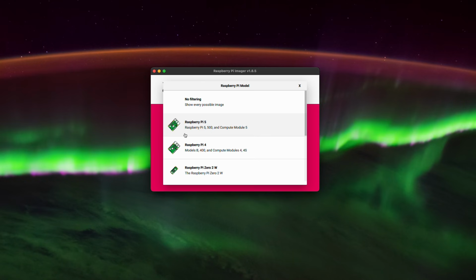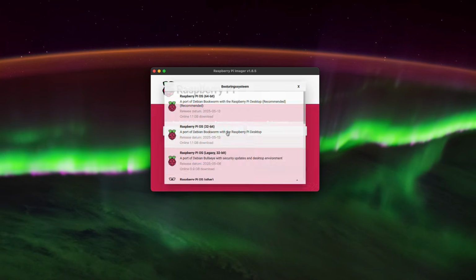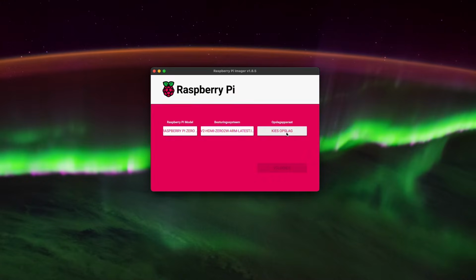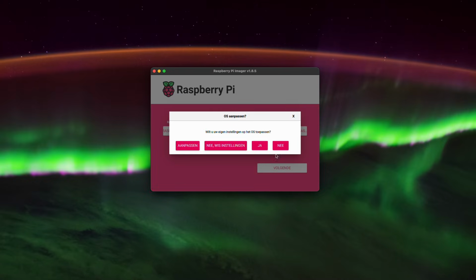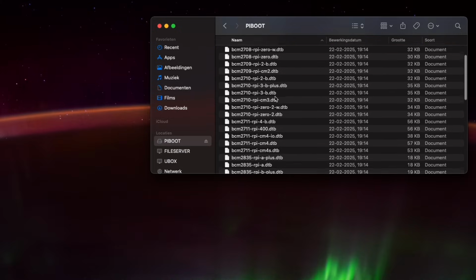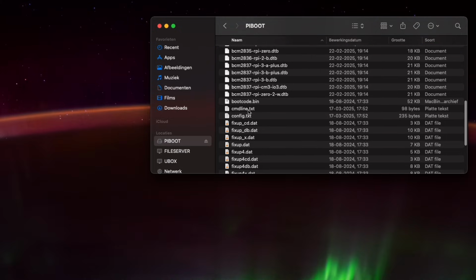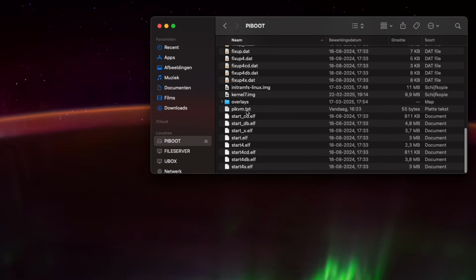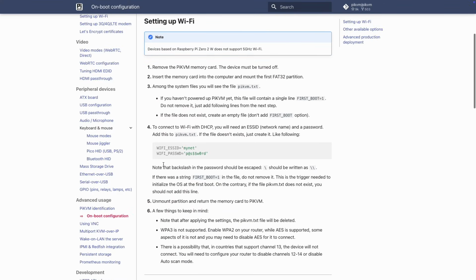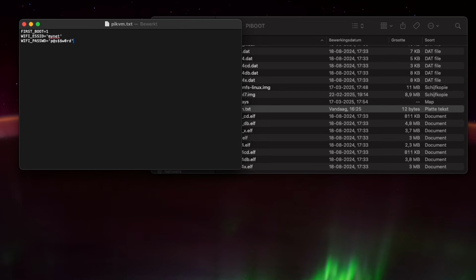and mouse controls working. Now just use the Raspberry Pi Imager or dd or some other tool of your liking to write the image to the card. Make sure not to supply customizations, as this image does not support it. After it's written, mount the first partition and look for pikvm.txt. Simply add these two lines and edit them to the wireless network you're using. If you're using a Pi 4 connected to Ethernet, you obviously don't need this.